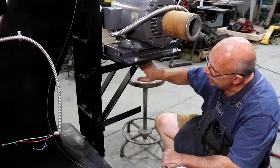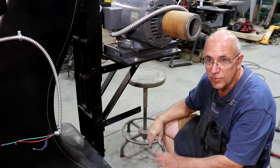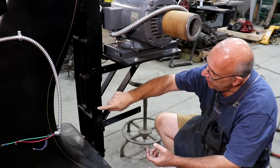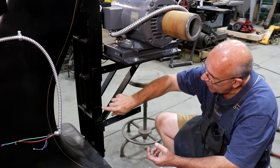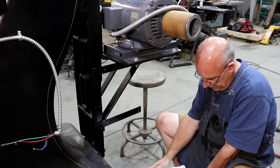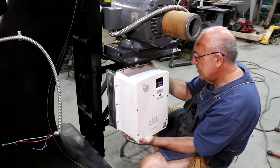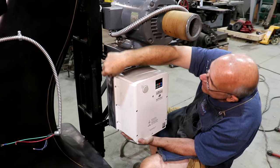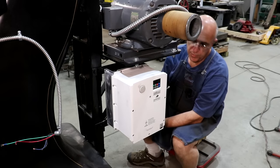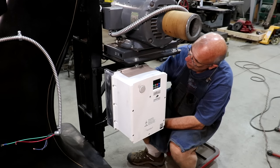To mount this on, I've come in and just put some metal brackets off of this casting, same as we had done with the motor starter previously, although I did have to make some longer brackets with different spacing. Those were the holes for the motor starter that was on before — I had to drill some new holes and make some new pieces. We've got some mounting holes in here, held in place with quarter-inch bolts. I'm going to go ahead and get these put in and attached, then tighten everything up and get the front off so we can start doing some wiring.